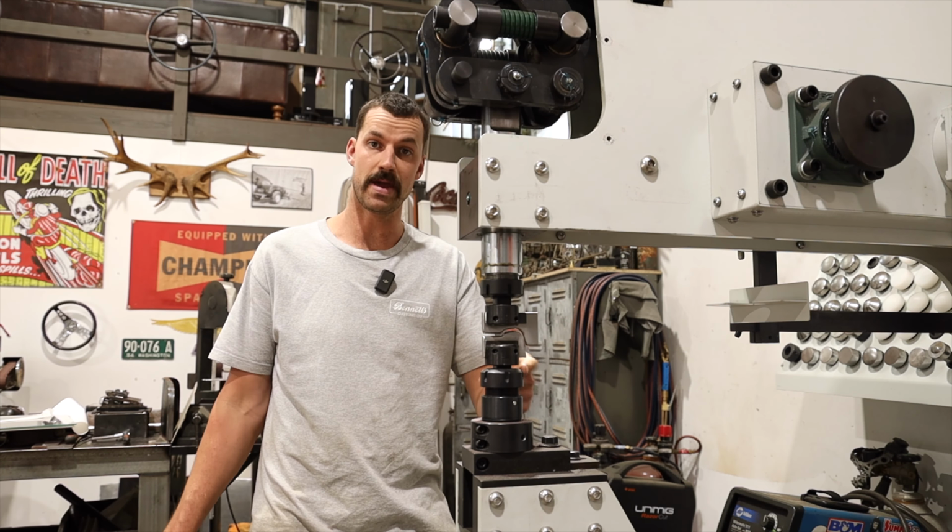I don't really wanna do both and then put it on there. I'd rather do one, hold it up, put the clecos back into place, making sure that we're in that area that we want to be. But I'm really liking the kick up. So it's obviously quite flat and then kicks up here, but you're not really gonna see it until I put this guy in. So you can kind of tell under here, obviously this is the straight bit for our channel bit for our subframe. And you can kind of just see how much we've gone with it there.